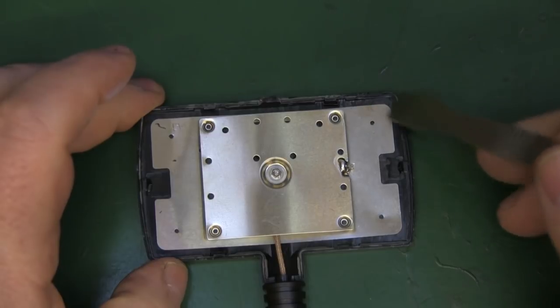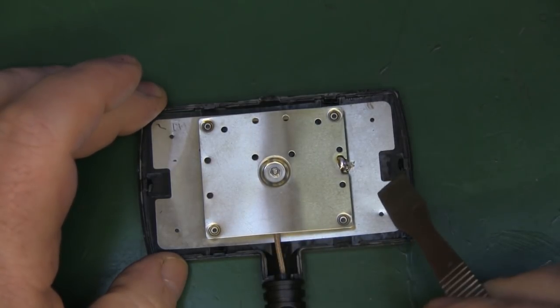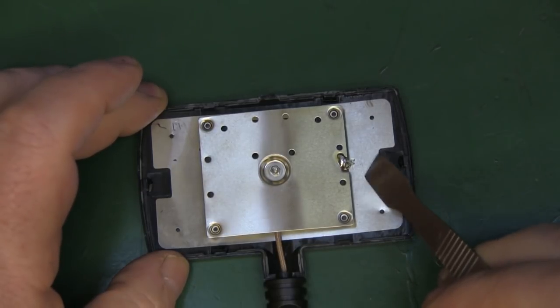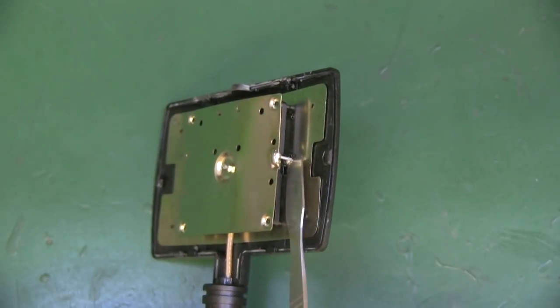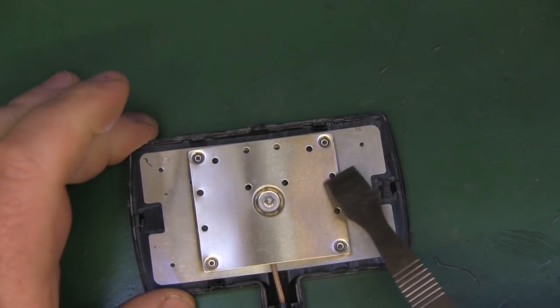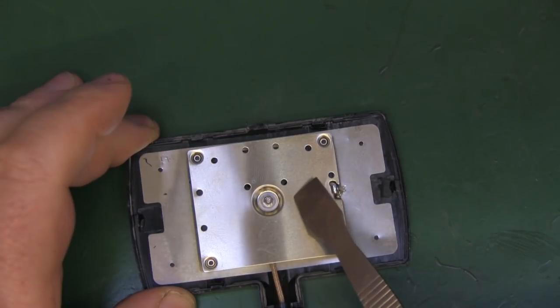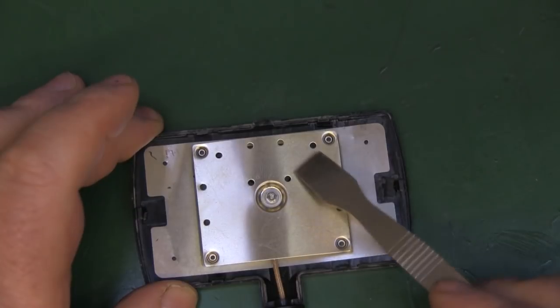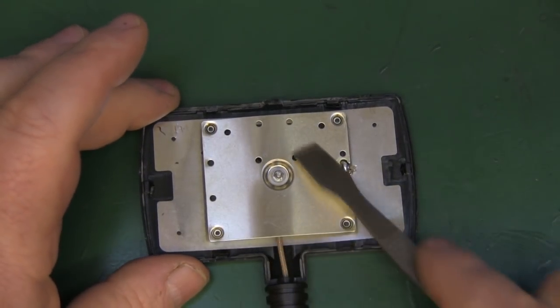Here's a look inside. It took a little bit of work to split the case because it's glued down as well as having plastic clips. It's a very simple design — we've got the reflector here, which is tin rather than aluminium because they've soldered directly to it. This is the main driven element. The coax comes in at the side, the ground plane is soldered down, and then the main driven element is on the other side. It's not going to win any awards with the VSWR — to get the VSWR down you need to create a feed point with a slot cut out and feed it somewhere close to the center. But as we saw in the Wi-Fi scan, it does work, and it does seem to be about 1 dBi more powerful than the Alpha one, so probably around 8 dBi with this single driven element.